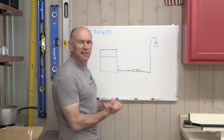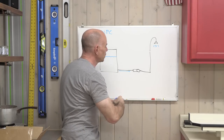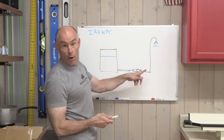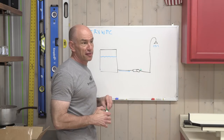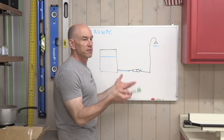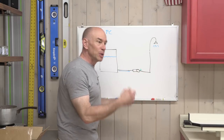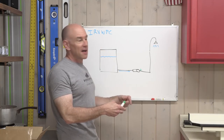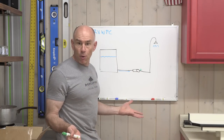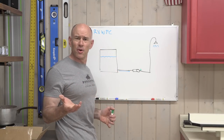The way it works is very simple. There is a little pressure switch on the output side of the water pump, and basically it's set for a certain pressure like 50 PSI. If the pressure is greater than 50 PSI it shuts off; if the pressure drops below 50 PSI the switch says 'I need to turn on the pump,' and then the pump turns on. That's kind of how it works — very simple design.